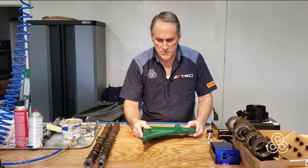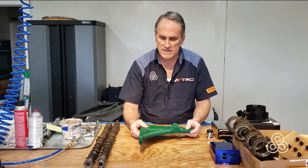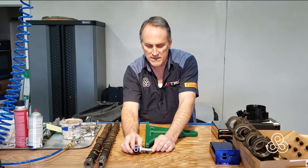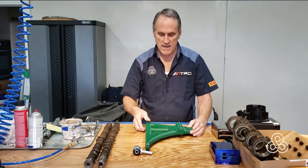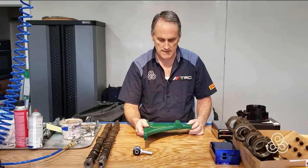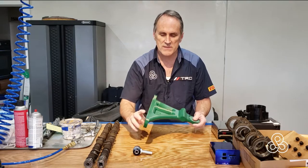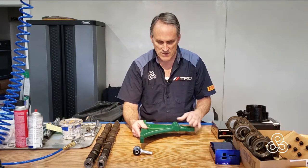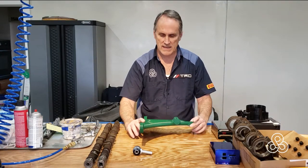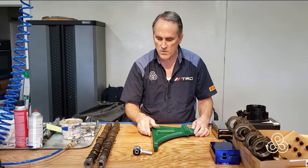We have another part that we have 3D printed. This is the lower control arm in the front. A ball joint will be pressed into here once that's bored out, and these bushings will fit in here — pulsed in the front and back to allow some movement for camber and caster control. We measured those and they seem to be just right. This one is ready to finish for sand casting — it's going to be used as a pattern. But 3D printed parts don't work well in sand casting because the fine little grooves tend to lock onto the sand. So this will need to be sanded down and any imperfections filled to make a proper pattern. Since we know this one is good, we'll also print the mirror image that goes on the right side of the vehicle.